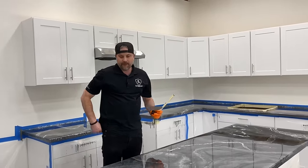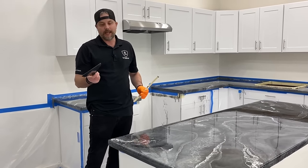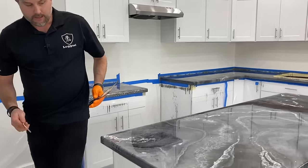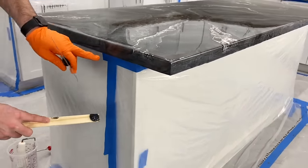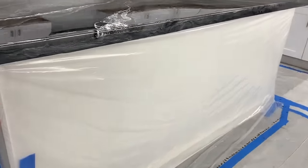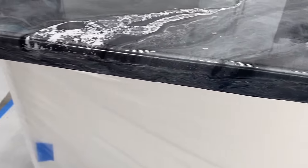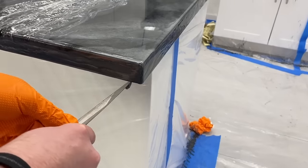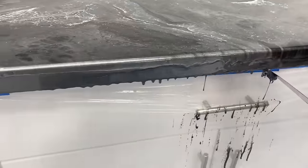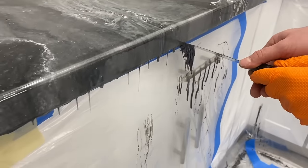It's still going to be dripping, but I'll show you how to scrape your drips. If the resin is getting sticky and set up, you want to use something sharp — it's almost going to cut the resin off. If it's still really fluid, you can use a paint stick. When it starts to set up and build up on the edge if it's sticky, take a scraper — something flatter — and it's going to almost cut that off cleanly. You want to be careful not to gouge the side of the edge. It's still a little early — you'll probably have to do this periodically over the next hour to hour and a half. You'll want to scrape your drips that way you don't have to sand them the next day.